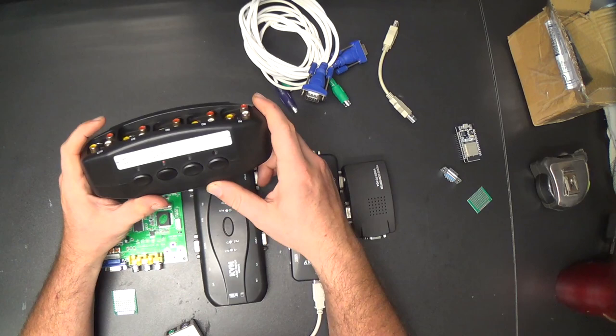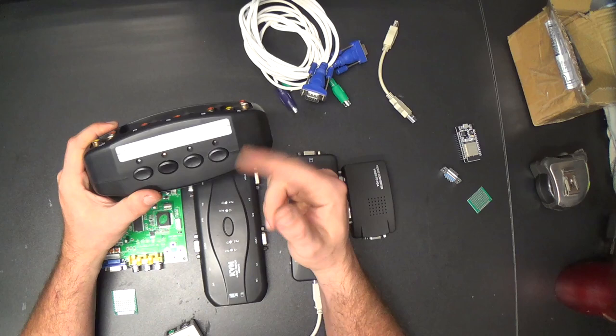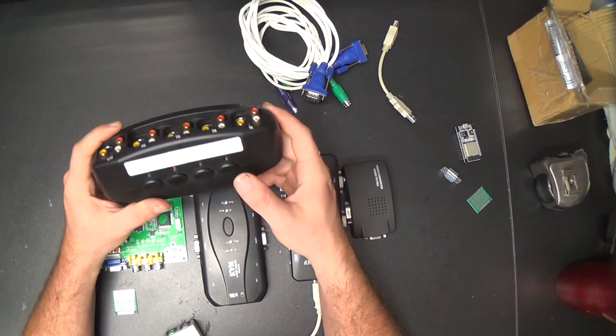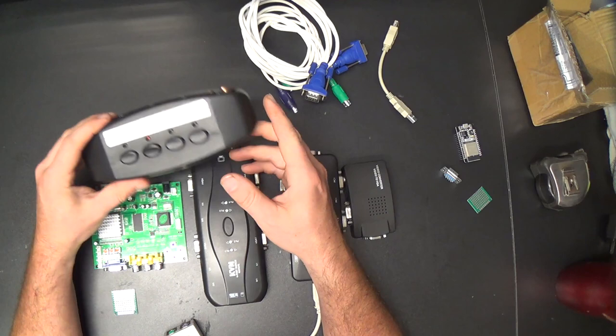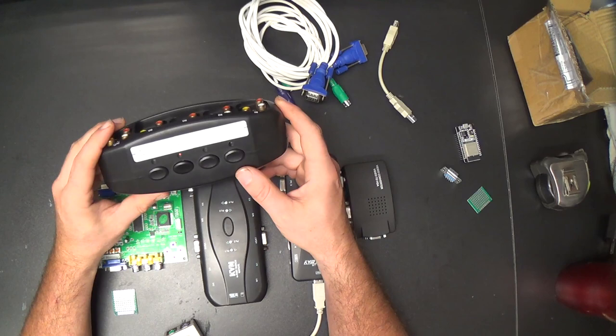Some kind of anti-spike diode across the data lines on the data pins on the switch. I could take it apart and add those maybe. Maybe that would keep it from messing up. I don't know. And I assume we'd tie all the power lines together through diodes to keep them from backfeeding each other too, you know. So that would keep power line connect and disconnect from causing problems too. And maybe it just has something to do with differences in ground potential, and the grounds would be connected together too, and that would eliminate that. So I don't know. That's my thought on hot swapping ADB anyway. I've never messed anything up doing it, but I've read stories about people that have, and I'm not gonna cast aspersions on them, because who am I to say that it doesn't happen one time in like 10,000 or something.